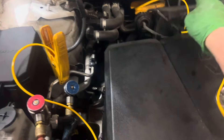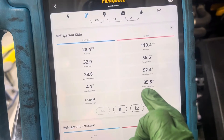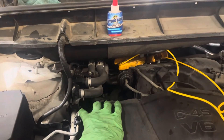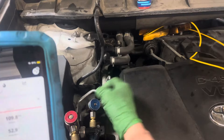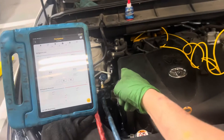If I take this and get it over there, it'll drop from 20. Let me show you — this is what the internal heat exchanger does. I'm trying to clamp onto it. We're reading 33, 35, 36, 37, 38. So that is what the internal heat exchanger is doing. Remember we're at 20-something over here, we're at 38 over there. The internal heat exchanger is removing heat out of the liquid line, so there's more energy to do more work as it passes through the expansion valve, giving you extra load capacity.